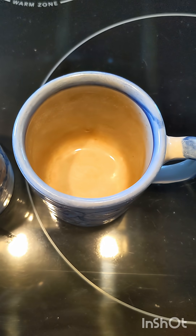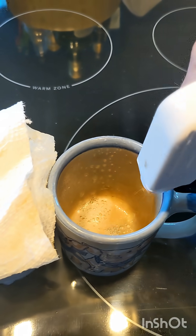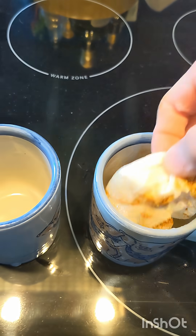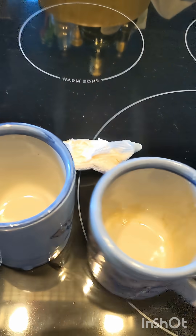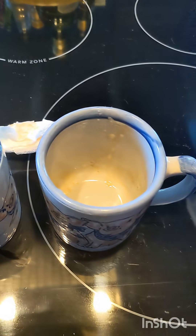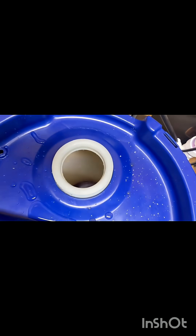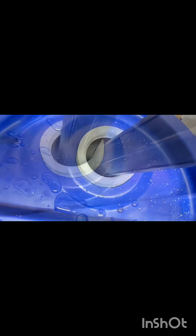After a couple of weeks of using our new beads in the water softener, I realized that our dishwasher wasn't getting our coffee cups clean. It turns out four parts per million of chlorine is a lot, and that was also going into our septic. These 8% cross-linked resin beads had been destroyed by the chlorine in our municipal water after four years of use.